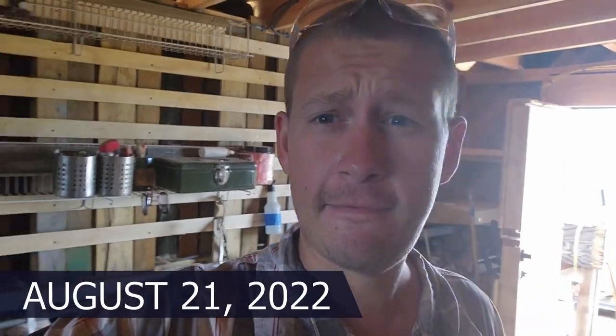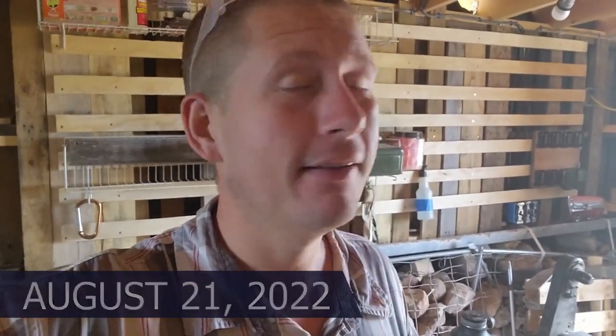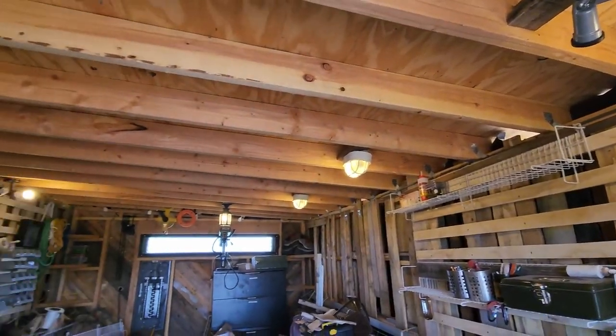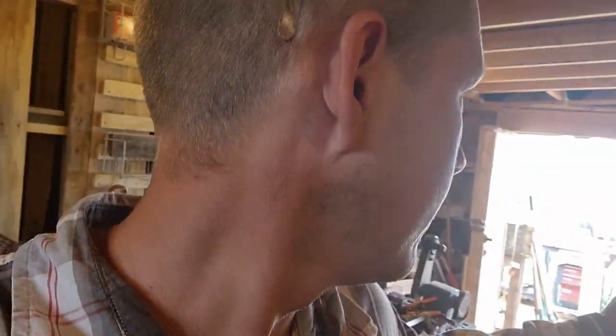Good morning everybody — it is day four if you count the trenching day on our electrical work. Definitely didn't think this would be that big of a project. I got the hot line switched over on the outlets, flipped the breaker on — there's our set over there, and there's our set over there. This is so much nicer. Next step is to get our outlets in: one, two, three, our GFCI on the side makes four, and then five and six for our battery chargers up here. Luckily I have lights now — this is way nicer.